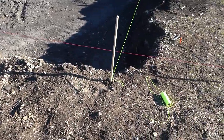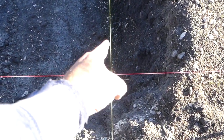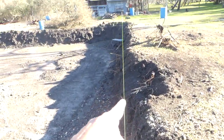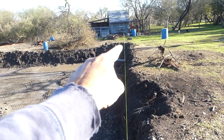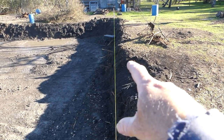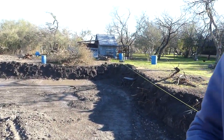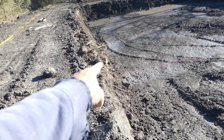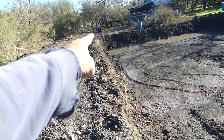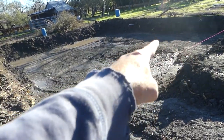And just like that, we have one corner here where the pink and neon green intersect. And down there, there's a neon green going that way and one going this way, and that's the other front corner. You can tell that I'm pretty much right inside the box that was dug out. Nice work, Espen. On this back side here, we come 11 feet off of here, put a stake, same thing down here, run a string, and that's going to be the back side of the barn. And we will have a complete four-sided box.